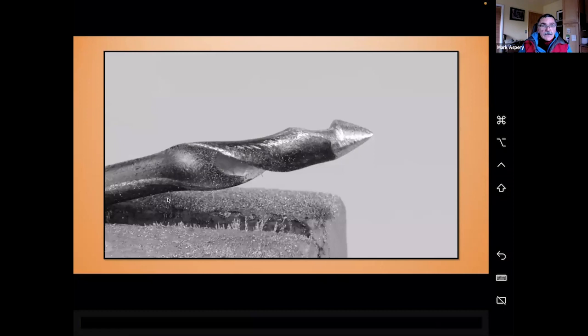That's another close-up of the same thing. I'm just chasing this around, trying to maintain the angle. And when you start this, you might find it useful just to set an angle up on your vise. Just draw a line across both jaws with the chalk and make a few of these, so let's say 3/4 of an inch apart, to allow you room to move when you're filing this. And that way you're always going to get the same sort of angle.